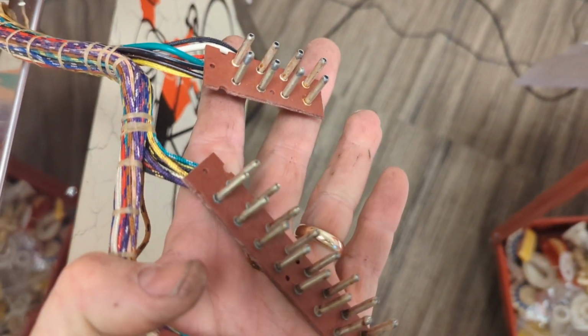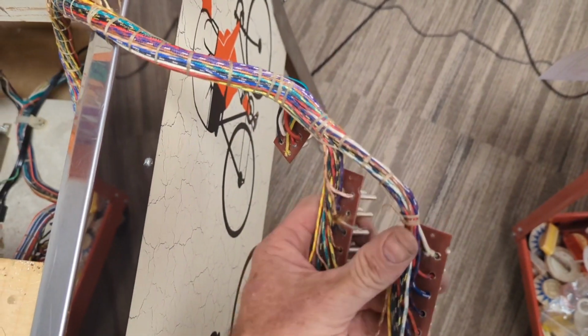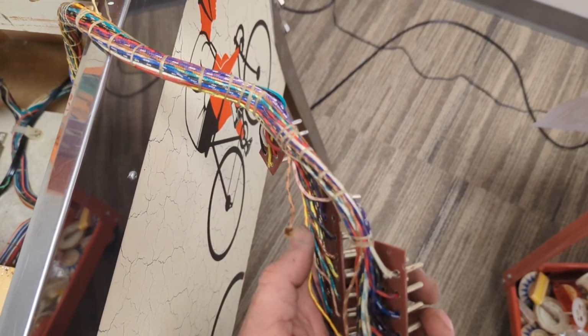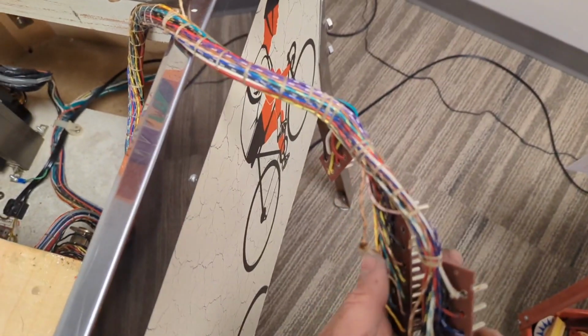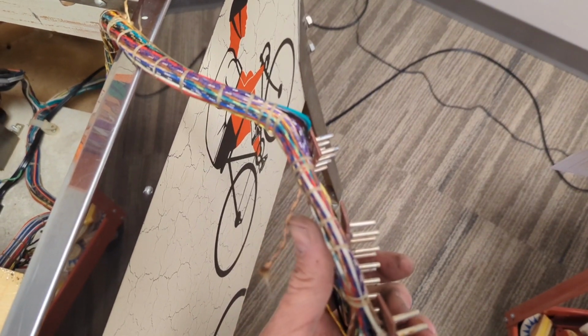And, you know, these didn't really need cleaning. They weren't that bad. I just used a Scotch-Brite, actually. I usually use a wire wheel. But just laying your hands on everything and going through every single switch. There's a couple switches that were misadjusted. Pulling the Jones plugs and looking at them, you find stuff like this.